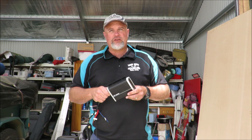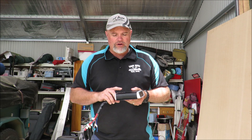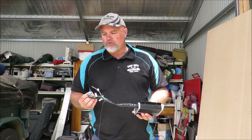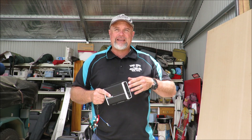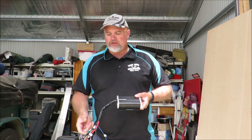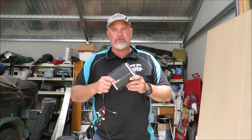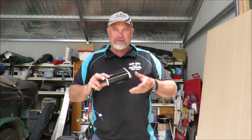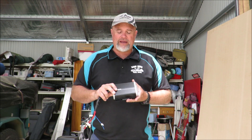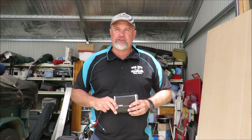If you don't have solar panels yet and want to use this purely as a DC to DC charger in your four-wheel drive, camper trailer, or caravan, you don't have to use the solar input — just tape that up and use it purely as a DC to DC charger, then wire solar in later if you add panels. Equally, you don't have to use it as a DC to DC charger; you can use it purely as an MPPT controller. It's an expensive way to go about that, but you might plan to use the DC to DC function later on.